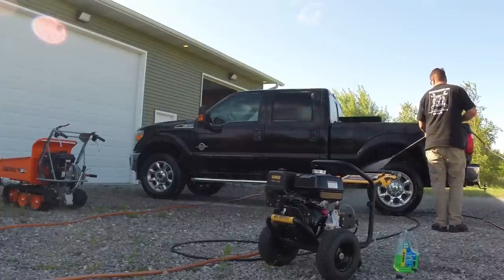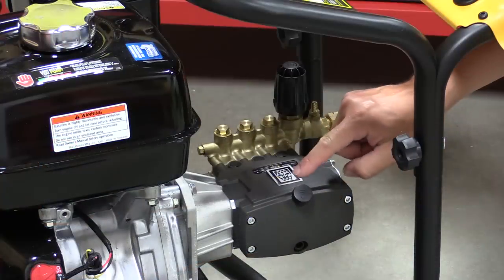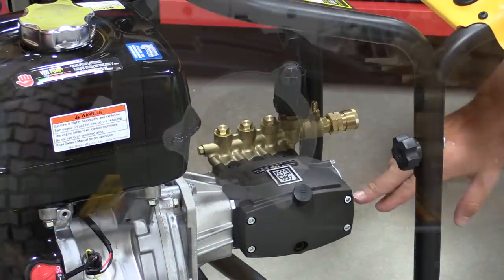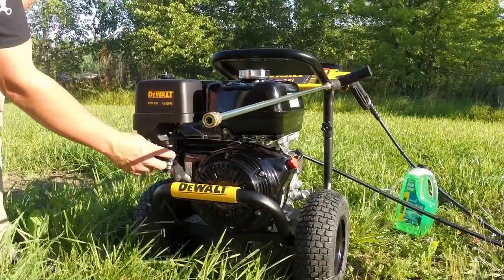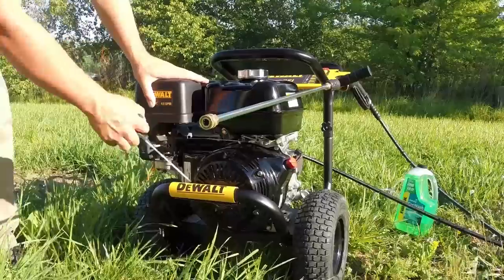What's really exciting about this pump is the lever that lets you reduce or increase the pressure through your wand — you can drop it down to roughly 2800 PSI or move it up to 4200 PSI to suit your exact needs. The replacement cost of this pump is approximately $300, and it allows you to change the oil inside. Check the oil through the see-through gauge on the back, and use a simple 15-40 oil, replaced after the first 50 hours and then every 200 hours.